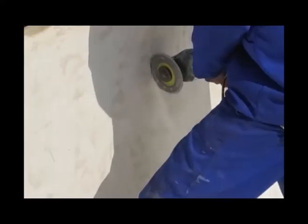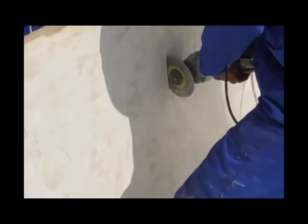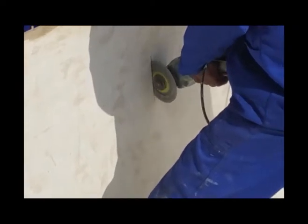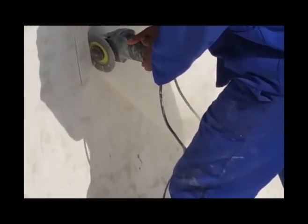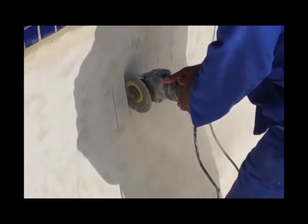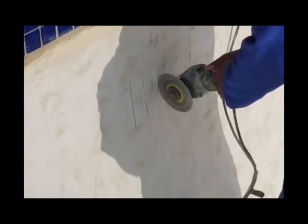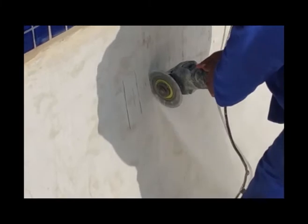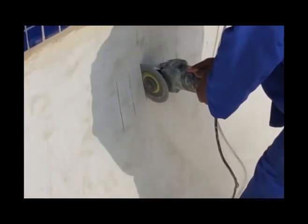In this video I would like to draw your attention to the fact that there are no wet spots appearing on the marbleite in this empty pool. There are no signs of dampness coming through. We will prepare the surface by grinding it open, creating a small square area where we can chip out the marbleite and see if there is any moisture penetration from behind the marbleite.